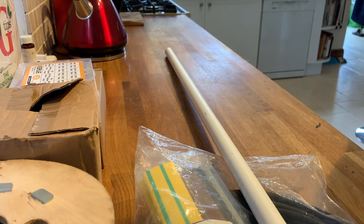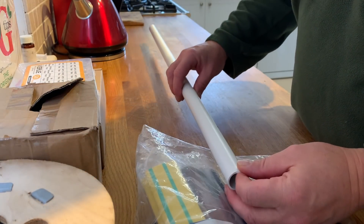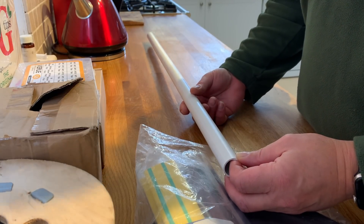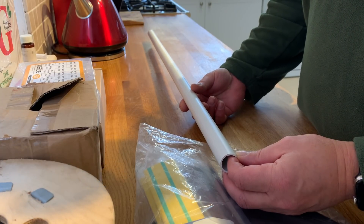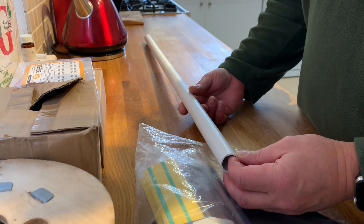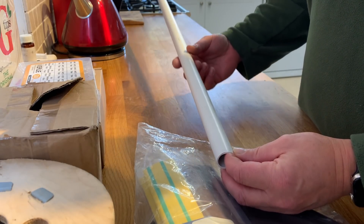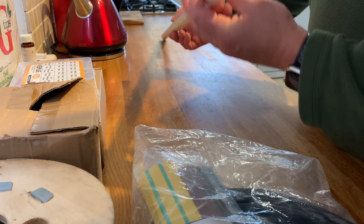Back in the kitchen. I'm going to make a 110 micro-Henry coil for 80 meters. I'm going to do an EFHW half-wave shortened version for a small garden, and I'm going to make the loading coil for it. I'm using — I don't know — 20mm or perhaps 22mm conduit. I'll measure it and we'll find out.